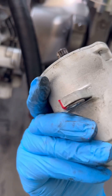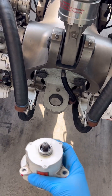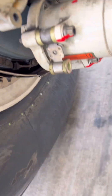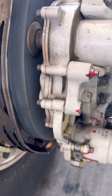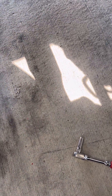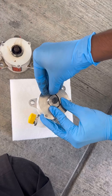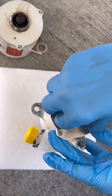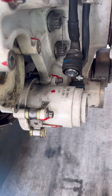This is our electrical brake actuator motor, and this is the mounting pad. You can see where the EBA motor is mounted in the gear train. Now let's prepare the new one for installation. We inspect the new unit, check the paperwork, and then the next step is to lubricate the new packing and install it on the motor before we install it.